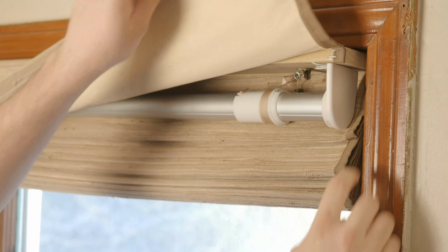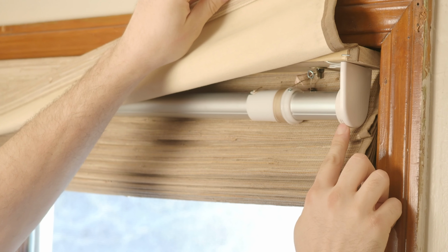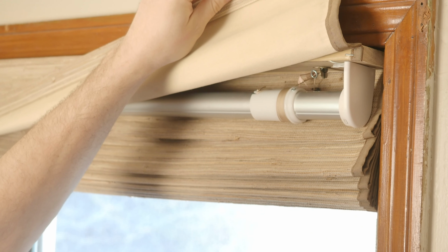Now, to do so, you need to press the programming button on the actual motor, and once you know it's in effect, it will jog the motor once. Now, from this point, you need to hold the stop button on the remote for 2 seconds, and then once it successfully pairs, the motor will jog again twice.